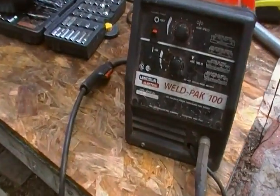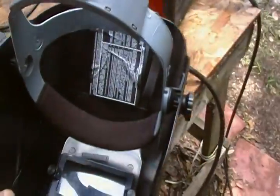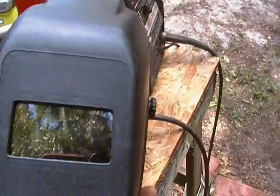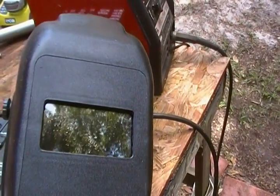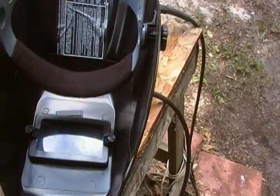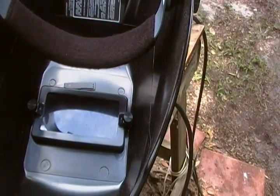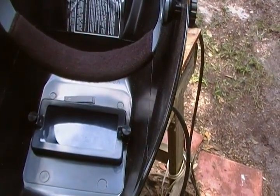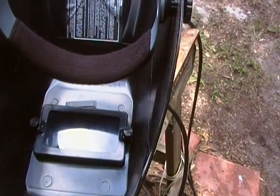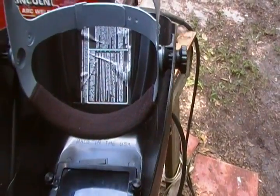If you're going to do any welding, you're going to need a mask. This one is just a cheapie — I think I paid $22 for it. It's got a number 11 lens, and I like the darker lens. The higher the number, the darker it is. Because those 9s and 10s leave flash spots in my eyes, and you don't want that. If you see that, get a darker one — get a 12 or something.